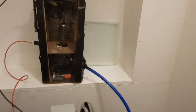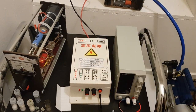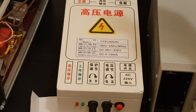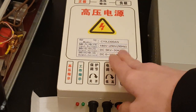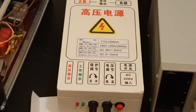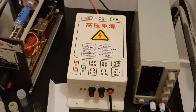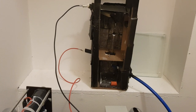The high voltage supply is the white one in the middle. I'll use this variable high voltage supply which can go from 5 kilovolts to 30 kilovolts at up to 10 milliamps. I will be using it at probably about 20 kilovolts for this examination, as the lead is still not thick enough to handle 30 kilovolts to a legal extent.